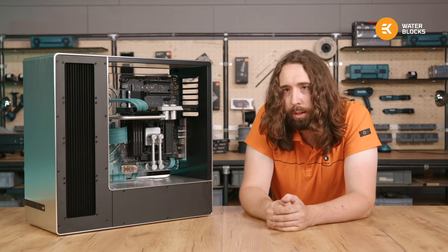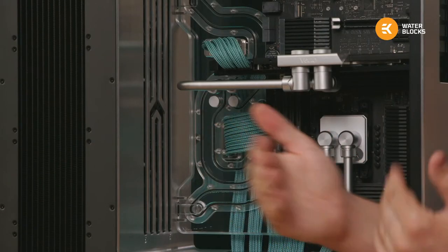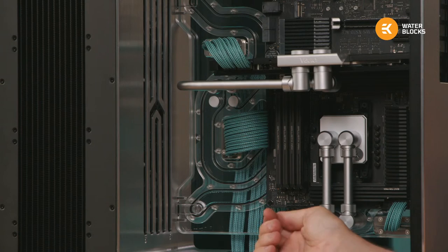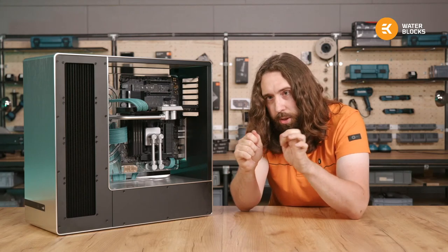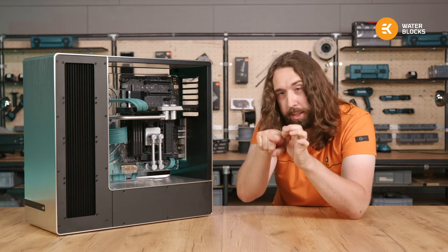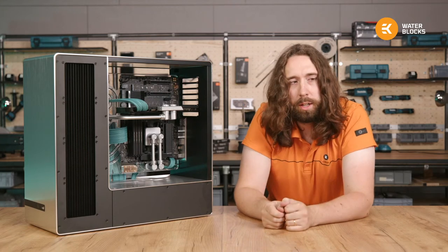underneath the mid plate, and took from, okay, this is pin 1 and it must go to pin 6, this is pin 2 and it must go to pin 9, this is pin 3 and it must go to 2 different pins, and then cut every single one. The double wires, which was three, I made it go to the furthest one and then cut around the insulation of the wire just once and pushed it apart, and then closed the wire up so there was a hole, put another short piece in that, wrapped it around and soldered, and then I had two ends on that one. So it was still one continuous cable but with another wrapped on for the second one.